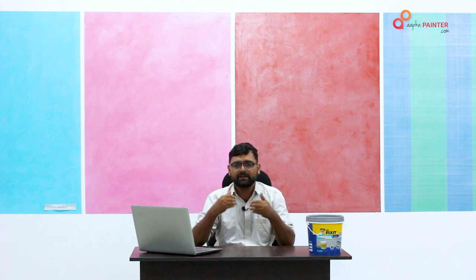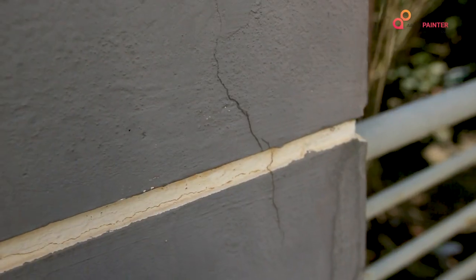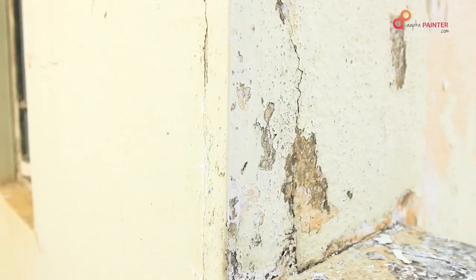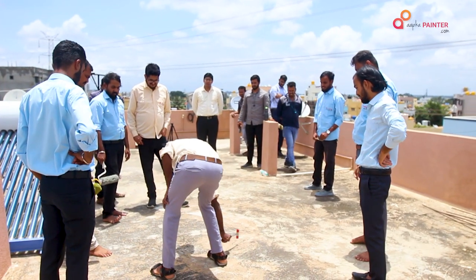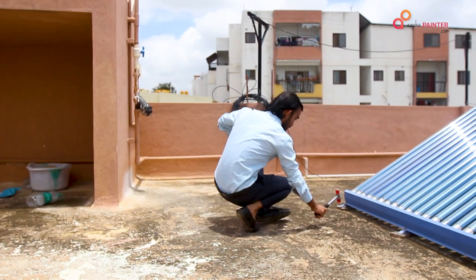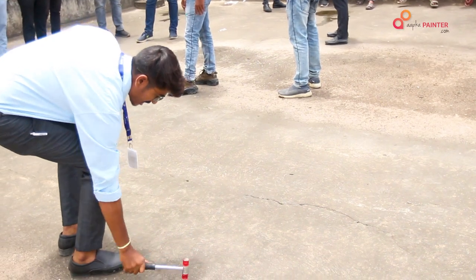The next thing is to check the slope on your terrace — how much water drainage is happening. The third thing is to check if you have cracks in the terrace. If you have concrete screeds, first of all take a nylon hammer and use it to tap and test the terrace surface.